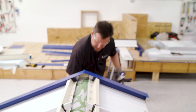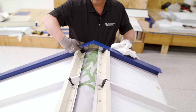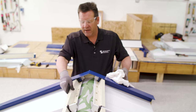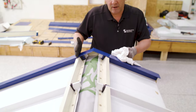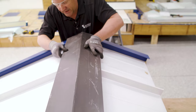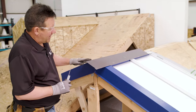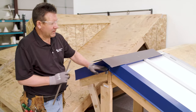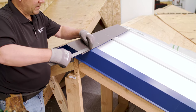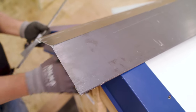With the rake in place, the Z-closure goes farther in and we need to get the ridge over the rake flashing. We have cut the Z-closure at our rake line so that the ridge cap will go on top of the rake flashing. We take our ridge flashing, hook that on, get it into place, and hook on the other side. Our ridge cap is on and now we're going to put an end cap to cap over our rake flashing. We measure the face of our rake flashing, which is four inches, and mark the ridge four inches back — that's where we'll tab down the face to end cap the ridge over the rake flashing.